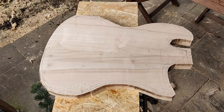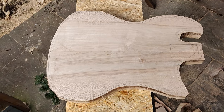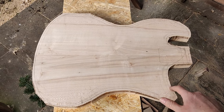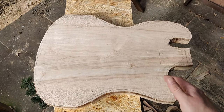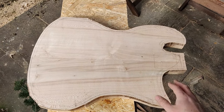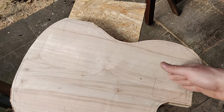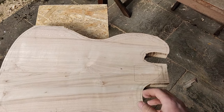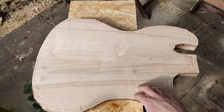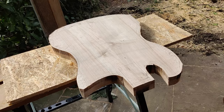The gluing compared to the previous one was a huge success — I'm really happy. And as you can see, I've been able to cut it to something that looks somewhat like a guitar. The rest I'm going to do with my router. The advice is to cut as close to the outline as possible, but I simply don't trust my jigsaw to cut completely 90 degrees. Also, going into corners is pretty tricky with this bandsaw — you can see some burn marks. So I didn't want to get too close. I just need to be cautious when routing around the shape.